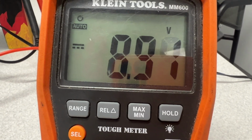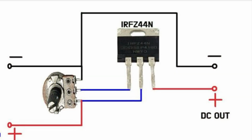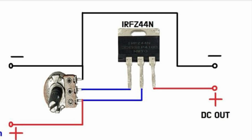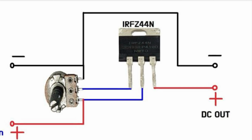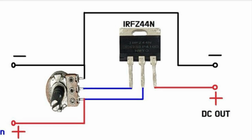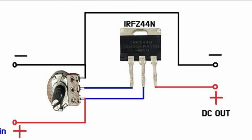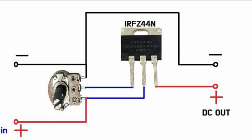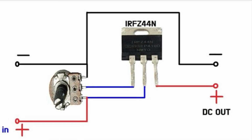The addition of the potentiometer allows us to create a versatile driver system for precise regulation of both current and voltage, crucial for controlling the magnetic force generated by the magnetic device. The MOSFET has an N-channel design which serves as the primary switching component that ensures power management. The potentiometer is connected between the gate and source terminals of the MOSFET. By manipulating the potentiometer, we can fine-tune the VGS, thereby modulating the current passing through the magnet, which results in a change in the magnetic field. This circuit can directly control the intensity of the magnetic field generated by the magnetic device.